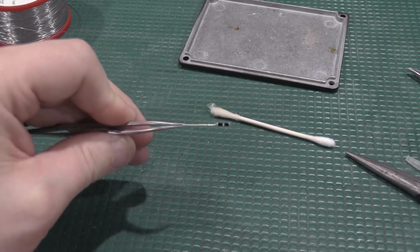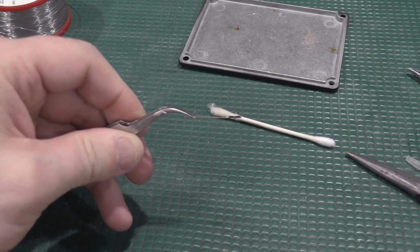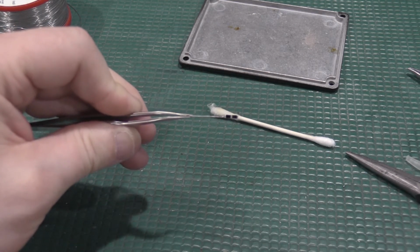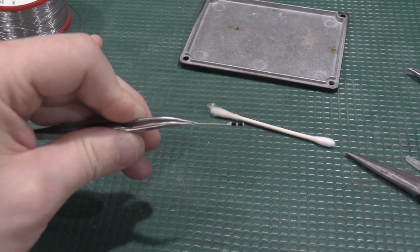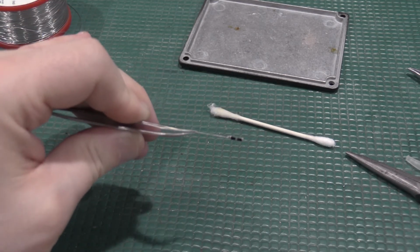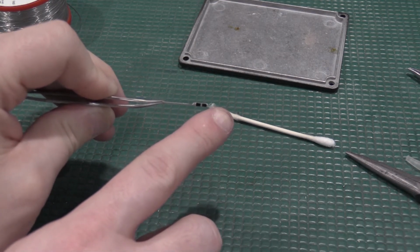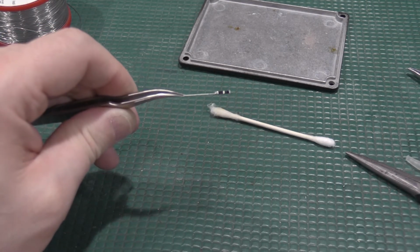Okay, here's our two 1206 resistors soldered together with a tail soldered on it to interface with the back of the pulsar tube. I did check the fit, and the tail looks long enough, so I'm going to solder the front of this directly to the termination resistor, so it's all going to be the same joint, so there should be no lead inductance on there.